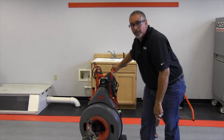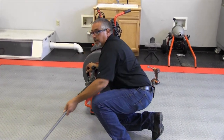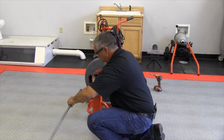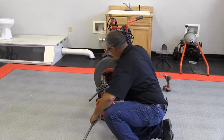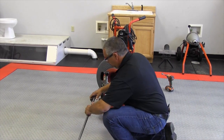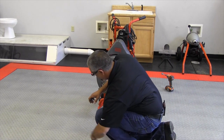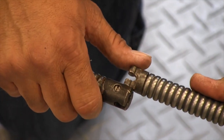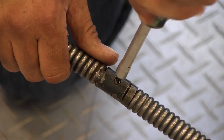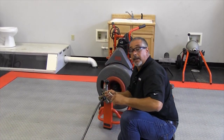At this point we're ready to connect our cable. This is the older style which are still out there — I'm going to show you the newer style in a moment. We'll slide that into the coupling. Make sure this is completely in the open position, slide that right in place, and then lock it. You turn it around until the notch aligns with the L on the cable. And that's how you reconnect your cable.